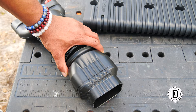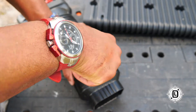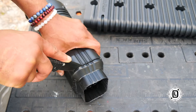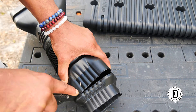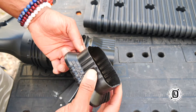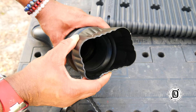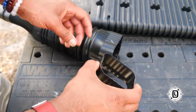When you look at your downspout, you're either going to slide this inside of it or make a cut and slide it on top. In my case, I have to make a cut, so I'm just going to take a utility knife or a sharp object and cut along the line it provides — just go along that line carefully. If you have the smaller gutters you can just slide it on without cutting, but I have the larger size so I need to make that cut.